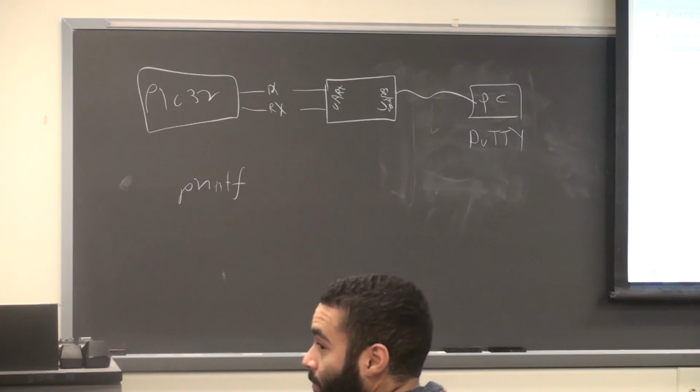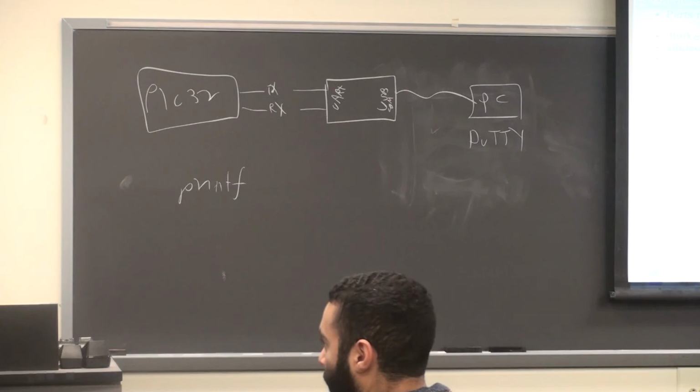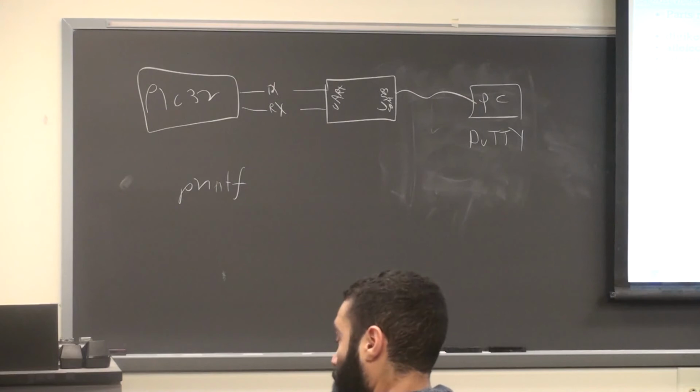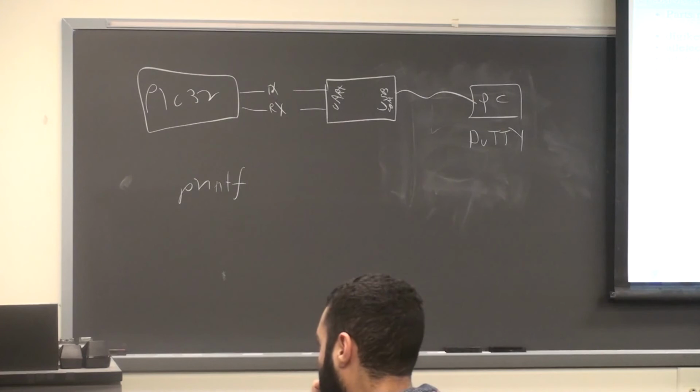How noisy are servos? How noisy are like Parallax servos? So how noisy are $10 servos? Generally, they have an internal feedback unit, and they tend to quiver at around 2 or 5 degrees noise. However, they have a fairly high holding torque. If you set them and then turn off the pulse train completely, they'll stay there with zero noise. They just don't have as much holding torque. So if you have a fairly low torque application,